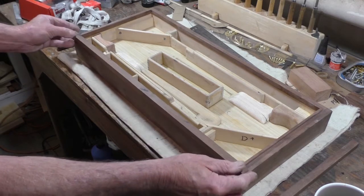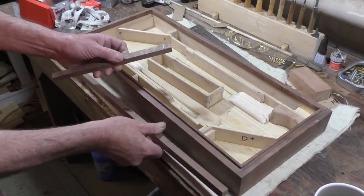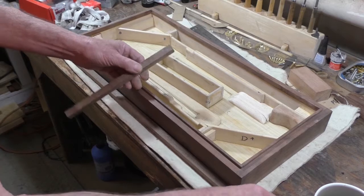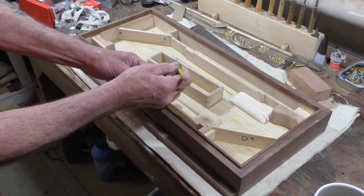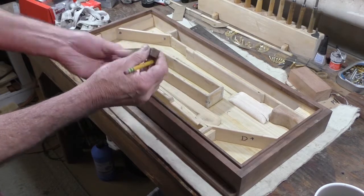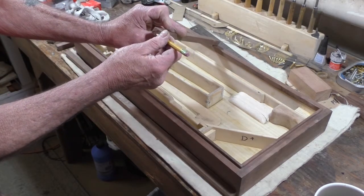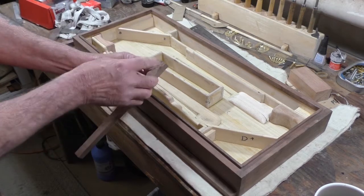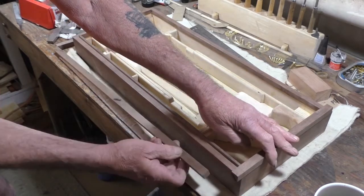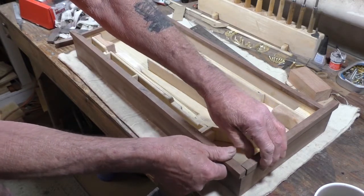This is marked front arrow up. So now what I'm going to do is a tongue and groove thing. I've marked all the way around with my square how deep it's got to go, and I've just kind of estimated here about a three-sixteenths tongue across here — I'm doing a lot of this by eye. I'm going to cut these areas off and this is going to be the tongue, then cut a groove in the front and back pieces so it'll go through like that.